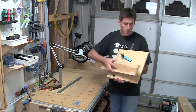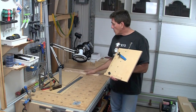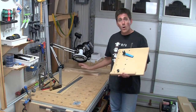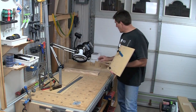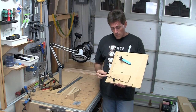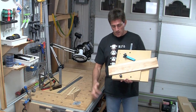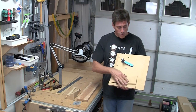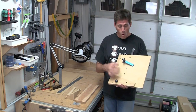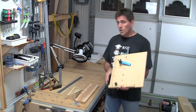Now since I glued the fence in, how am I going to make a miter cut? I didn't want something like the miter gauge where I'd have to readjust it between cuts. So if I have a mirrored cut, I didn't want to recalibrate or change the protractor to flip sides. I wanted to keep it the same, repeatable, and fast. So I created a series of triangles. You place the triangle on the sled, there's a screw to lock it in place, and you place the board right on the sled — that's the miter angle it's going to cut. When you need to cut the mirror, just unscrew it, flip it over, and you've got it. If I have a minor error in this triangle, at least it's going to be consistent — all the cuts will have the same error.